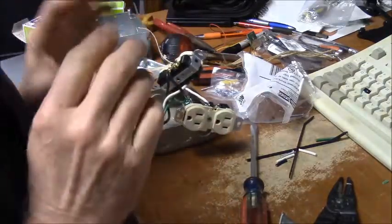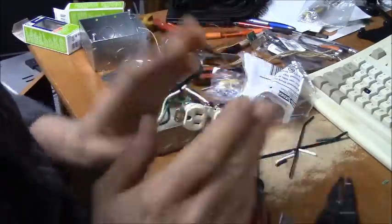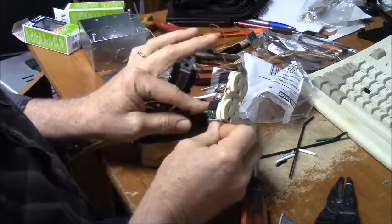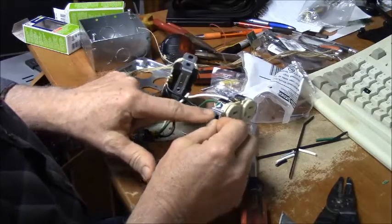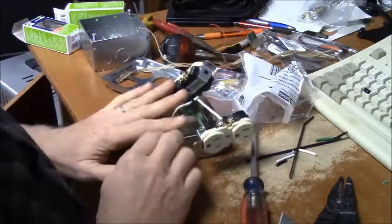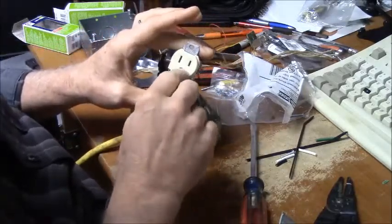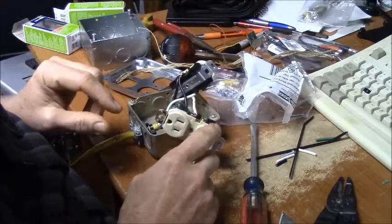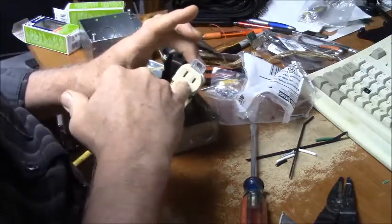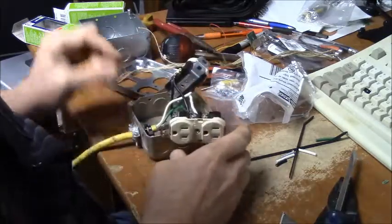Grounded. Now, let me give you a quick explanation when people talk about ground and neutral. Ground is always a green wire. It always attaches to any metal objects that the power goes through. And it's the horseshoe bottom plug, which if you look at an extension cord, the ground prong actually is longer, so it makes contact before it makes contact with the hot contacts.